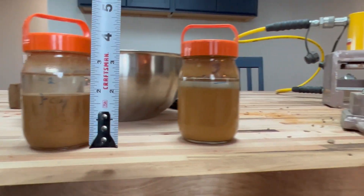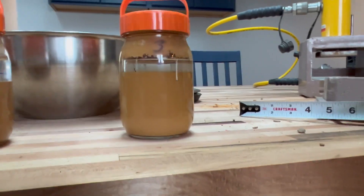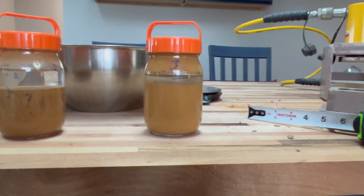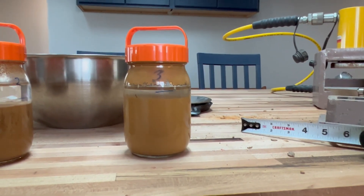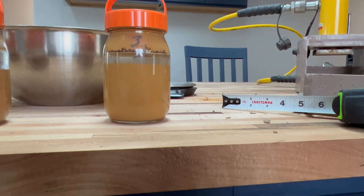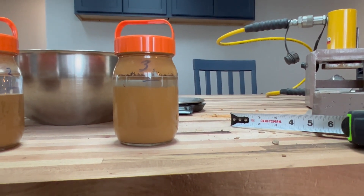If you get too much clay, like this sample here, I can't even make out a line, and you can see all the clay that's stuck on the shoulder of the jar — this is possibly pure clay, and that doesn't make for a good earth block. It definitely doesn't make for a good cement stabilized block. Unstabilized, it's just a little bit hard to work with — it'll possibly crack, it's real sticky, and it won't flow through the machine.